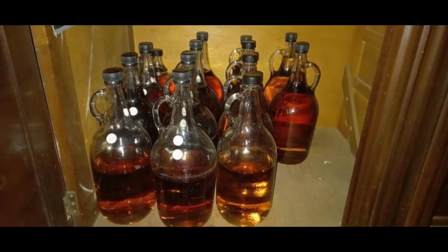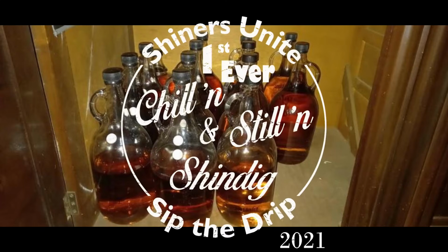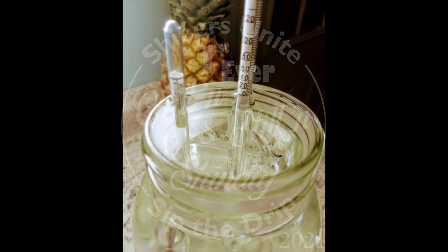Because the first few drips will come out just because the vapor path, all the copper hasn't heated up yet. So the first little bit is going to condense on its own, whether you have a water jacket turned on or not. But if you forget to turn it on, then steam is going to start coming out and you're just losing your alcohol. So make sure and turn your pump on as soon as you start seeing the drips.